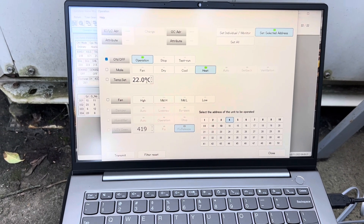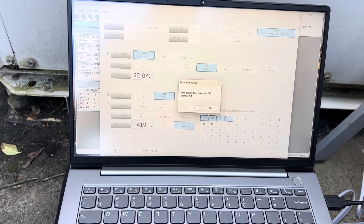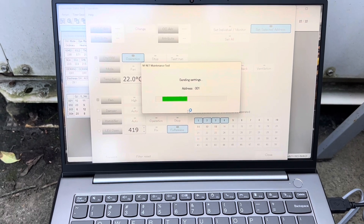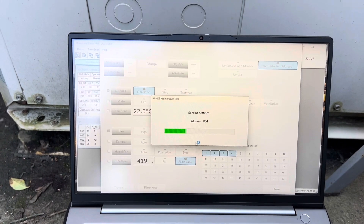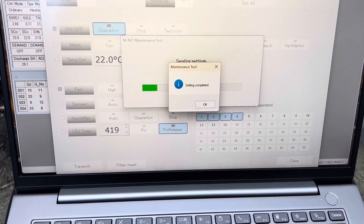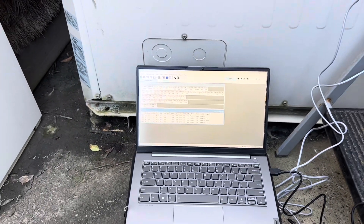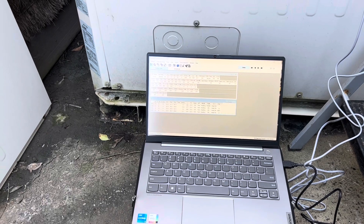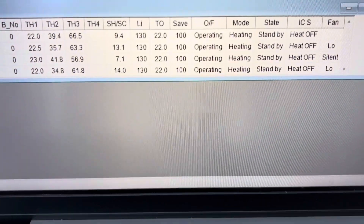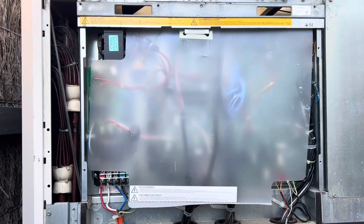Operation heat mode 22, high, transmit. You can hear that ramping down now. On the next cycle that should say off, because it's pretty warm and already past the set point for most of the areas in that room. It's uploaded and it says mode: heating standby — sweet, we're good. I'm going to pack up here. We'll get someone to come back and replace that isolator, but as it stands this unit's working nicely now.